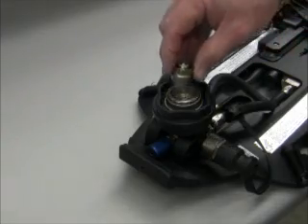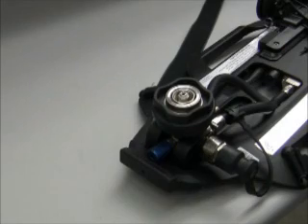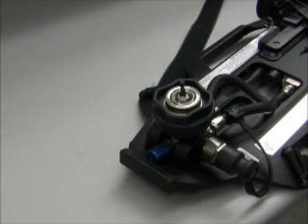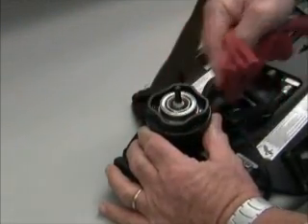To clean the quick cylinder connection system, connect the quick cylinder adapter and then fit the blanking plug. This will seal off the air inlet and prevent any liquid from entering the first stage reducer. Spray 3M citrus based cleaner liberally onto all outside surfaces of the coupling. Wait a few minutes to allow maximum penetration and loosening action, then wipe off any residue with a damp clean cloth, or blow off with air.